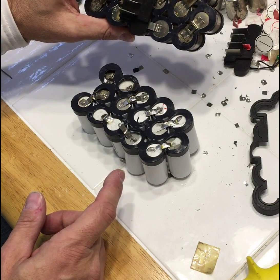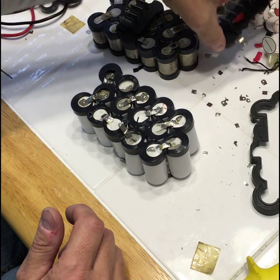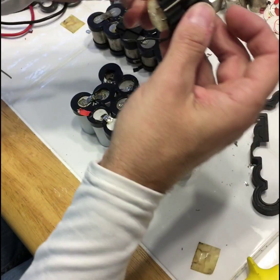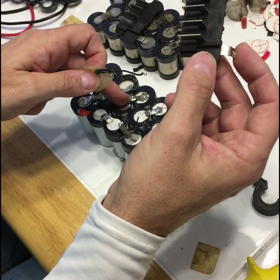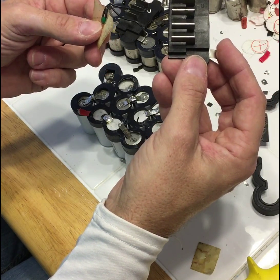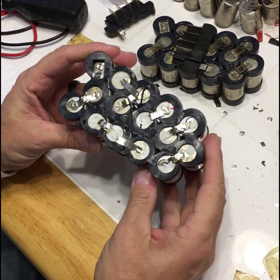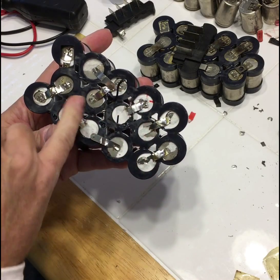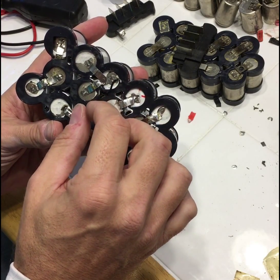When I'm done with the backside I'll show you how to put this back on. I also noticed the wire coming out of that unit I had taken the solder off on — this is a temperature sensor. It tests one battery, and it just goes up against that battery so that if the battery starts to overheat, that's what tells the charger to shut off. I took the temperature sensor and put it down inside with a piece of tape up against the side of the battery so that if it does start to overheat, that will shut down the charger.